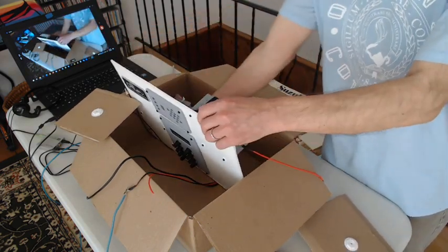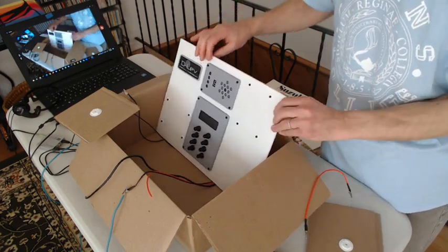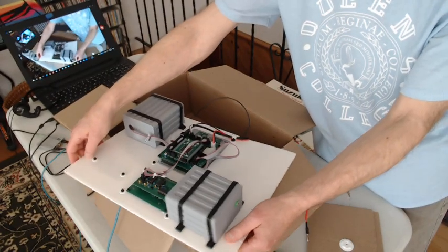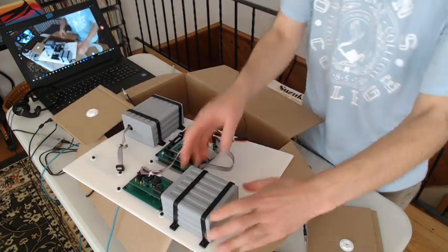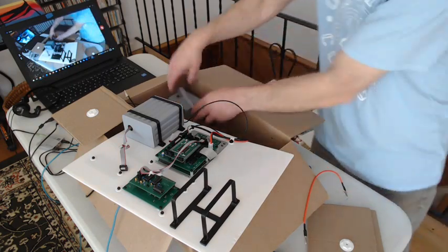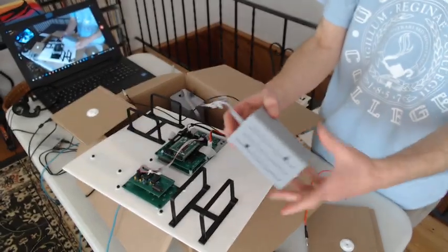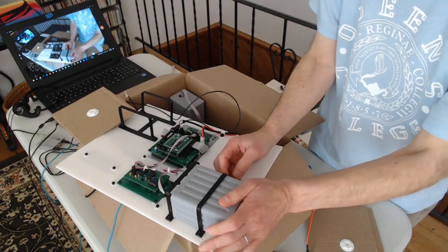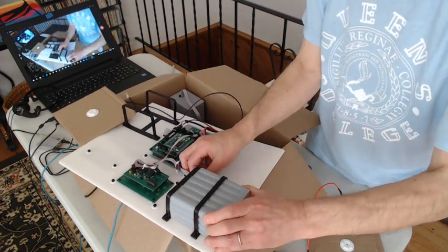Turn it off. That DAC box pop gets me every time. All right, what I did was I loosened up these 4 screws here and these 4 screws down here, just a few turns to loosen them up. And we'll undo the DAC box ribbon cables. And we'll slide out, or not DAC box, but the coil box, I'm sorry. Set this here. The coil box, so we're gonna move this one over here. And it doesn't matter really that it's a wider holder here, and this one's narrower, but yeah, not a big deal.